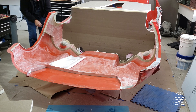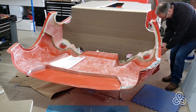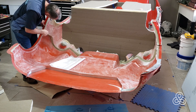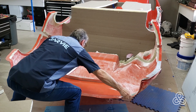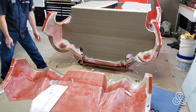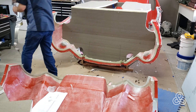The flashing comes off and now I'm just taking the bolts that are holding those joints together. There are some bolts that run all the way underneath the bottom — I tipped it up earlier and did that. As I try to pull it apart I realize there are a couple of places where my laminations for the flashing have gone up across the top of that little metal flashing and bonded together. I cut those apart and now it's fallen apart — the only thing holding now is where the hinges are going to go. They kind of click in there and lock in position, but we have the separation. I move these things apart to give me some room to work in there against that bulkhead, and there's some flashing in there so I pull that out of the way. Looks like I've got a good amount of releasing agent.